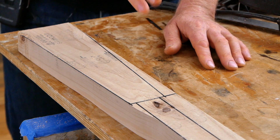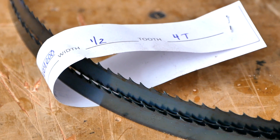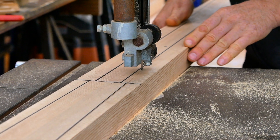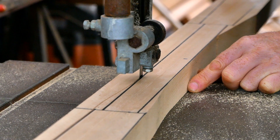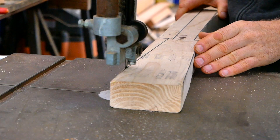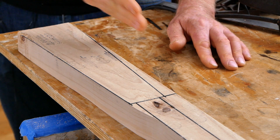The next tool you can use is a band saw, which is generally going to be more accurate than a jigsaw — but not always. The minimum horsepower band saw I'd recommend for this is three-quarter horsepower with a brand new four-tooth half-inch wide blade. The cutting process is the same — cut to the outside of the line until you get to the root of the blade, then drift over onto the loom line. The most common problem I see with people lacking band saw experience is over-correcting: they start to cut into their line, get nervous, turn too much, cut out of their line, and end up with a wobbly cut — almost like over-correcting in a car on snow.